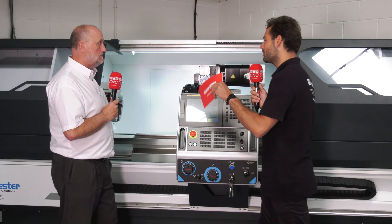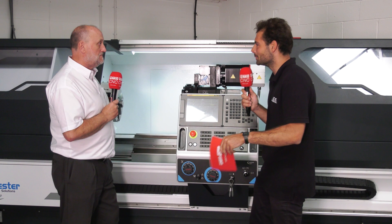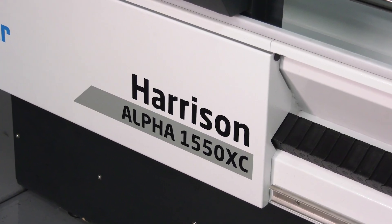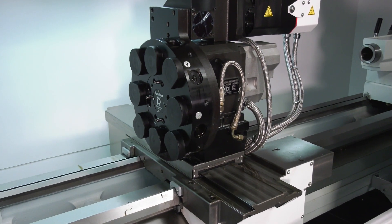I've never seen a three-axis lathe in this kind of configuration with the standard robust Colchester design. But what does that extra third axis allow you to make? To me it gives you your first form of automation. You don't have to take the job off to do any milling operations. You can do drilling and milling both axial and radial without removing the part. You get all sorts of benefits in terms of accuracy, less work in progress — it's not on and off the machine, you're not using other machines to do it, you get a completed part come off.